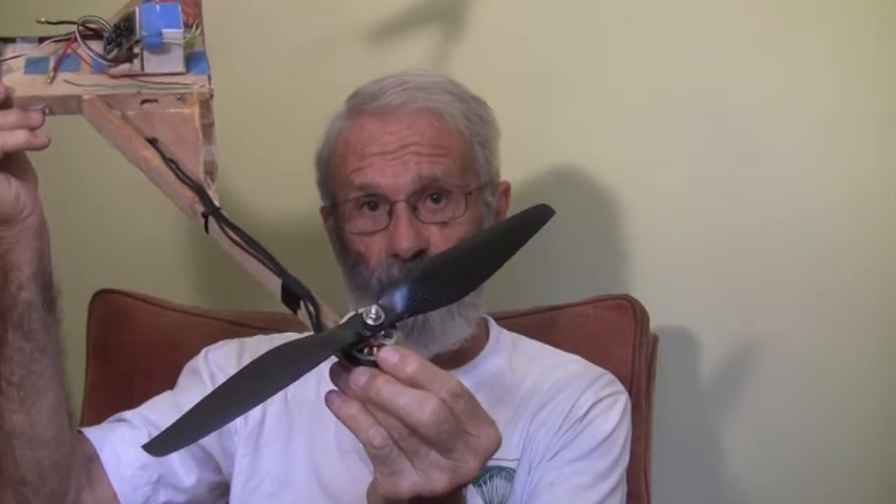I changed all these things and it made no difference. It took a few weeks before I got my head around it. There's so little in a multirotor outrunner motor to go wrong — you've only got magnets and coils, and both looked fine. I kept going back to friction, thinking about that circlip friction. And then I thought more seriously about something I had noticed when the motors were new: a little hint of blue epoxy at the top of the motor frame. I started to wonder about that, so it was time to dismantle the worst motor and see what I could find.